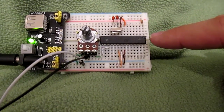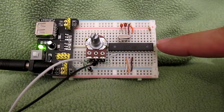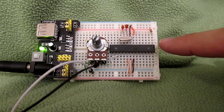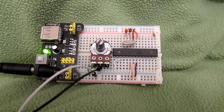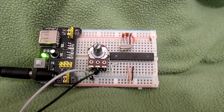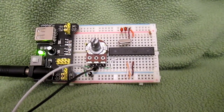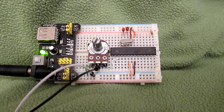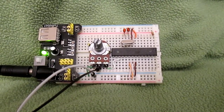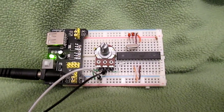The programming on here, which I'll put on my GitHub later on today, is based on somebody else's work to synthesize sine waves based on PWM and some sort of interrupt-driven routine. It makes a pretty pure sine wave. I just got in there and hard-coded it to generate a 107.2 hertz tone, which is what our repeaters here in South Texas are coordinated on.